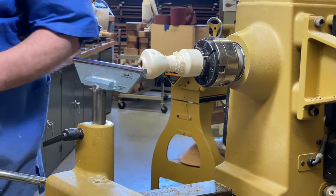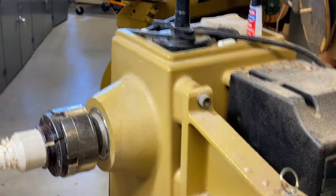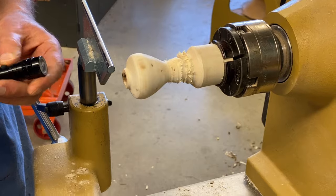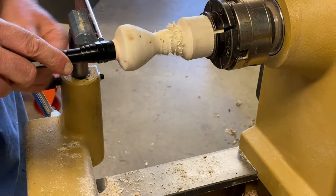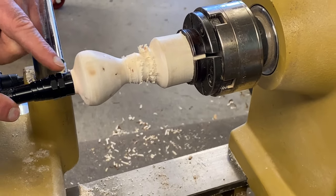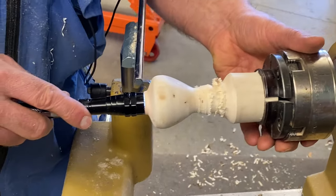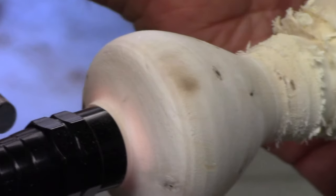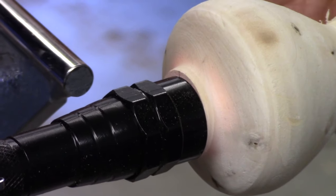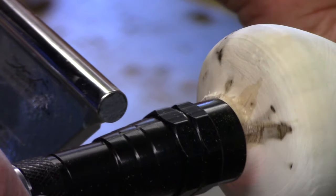There's another technique that I like using, and that is with the flashlight. It requires an additional step of moving your banjo, and when we turn this on, if you see any illumination, then that means you're getting pretty thin. So the thickness is appropriate there. The maple shows up nice. Something that's going to be deceiving though is that if your piece of material has heartwood in it, it's dark, it's going to absorb the light more. So you're going to have an inaccurate reading with regards to the illumination with that.